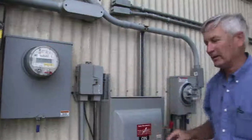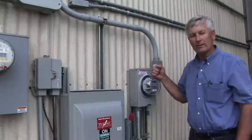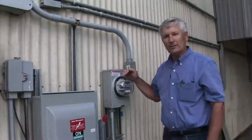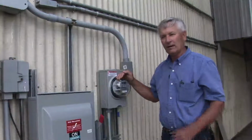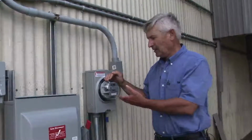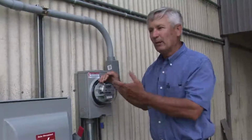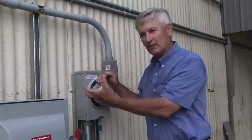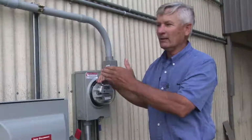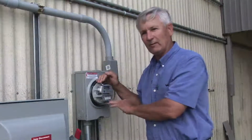The next meter we're looking at is this one, and this is the meter that is actually the power that's being produced in the solar panels. This actually discounts from his electric bill. A typical example is around $300 to $350 a month is what comes off a typical electric bill with this meter running per month. Plus the energy that you're actually making with the solar panels, yes, you're getting paid 11 cents per kilowatt hour here, but you're also able to consume that electricity at no cost to you, and you get paid for it as well.